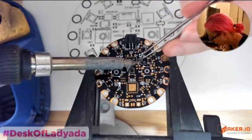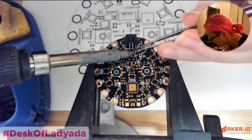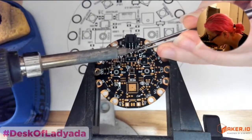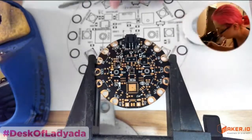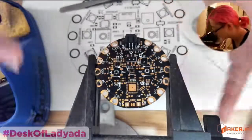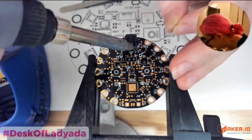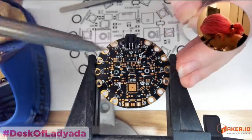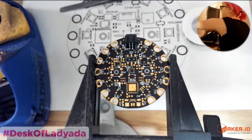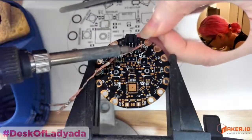While you're doing your prototyping, you might end up using parts that are a little easier to solder. There are some times when this part is available in BGA or QFN, and you're like, okay, for the prototype, I'm going to do QFN or TQFP or whatever to make it easier to solder. But you will eventually have to go with a BGA part for some reason, so just be aware of that. You can solder BGA parts, it's just difficult. And then don't forget your wick, when you make a little bridge.